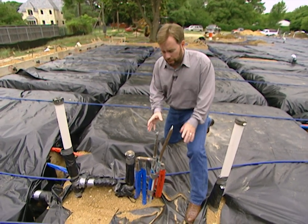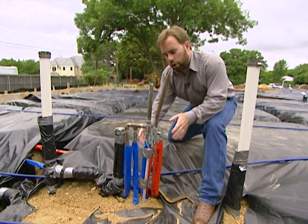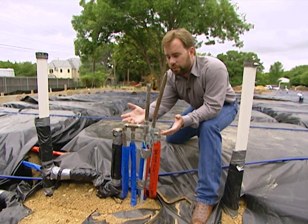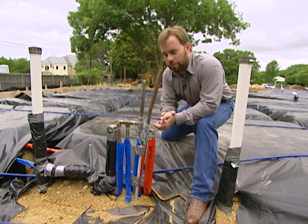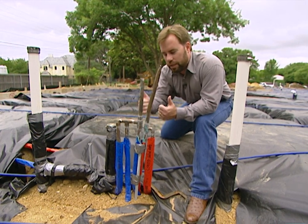I'd really like for you to look at this copper manifold here because there are some interesting points. All of the joints are up above our foundation floor — we're going to pour concrete for this foundation, so we need to get all of the joints up where, if they ever leak or we have a problem, we have access to them. If they leak below the concrete foundation, it's going to be next to impossible to find the leak and we're going to tear up a lot of concrete. It's going to be very expensive. All the joints need to be up in the air.